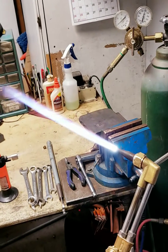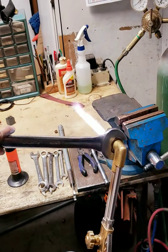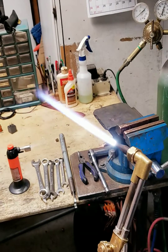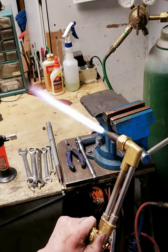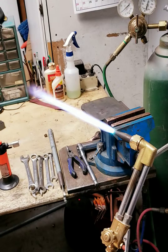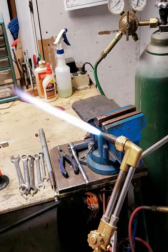What we have going on here is a loose torch tip, or a cracked nut, or a bad seat — something is going on in that area. If you've got a torch tip doing that, you can tell that's what it is. Now we're going to test this torch. It's still popping back in, it's got an old tip in it, and we know this thing has a bad torch. I chose this torch because I know it's going to fail.